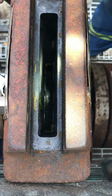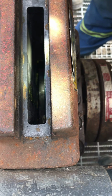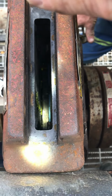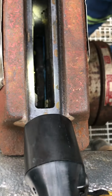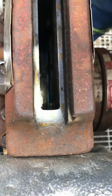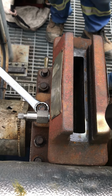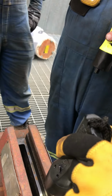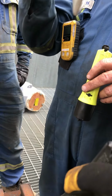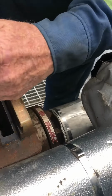So we're going to open it up. Not going to close it, just going to open it up. That's good. Okay. So I know it's okay. Now, at this point, we're going to run the carrier up. So you see when we run the carrier up, have you noticed the problem right now? It's tighter on the one side. There you go. That's what would happen if you tightened it up right now. Now, if you know that seal in there and it's coming up and it's tight on the one side, what's going to happen? It's going to scrape the seal. It's going to catch it and rip her out. So the best scenario for that is that red hammer. Dead blow and just put it in there. We're going to align the head.